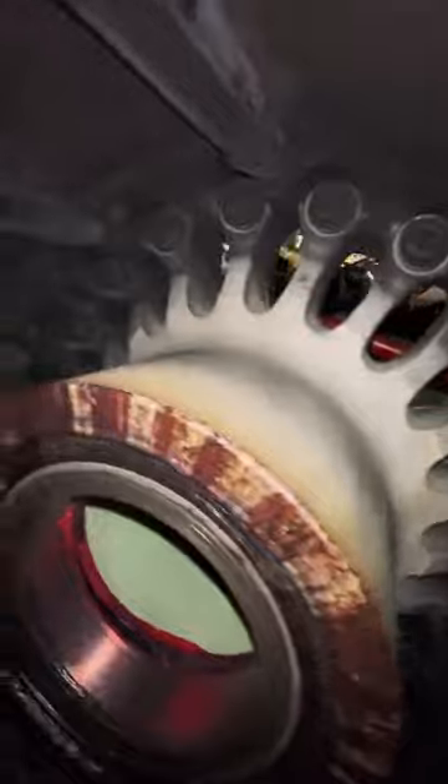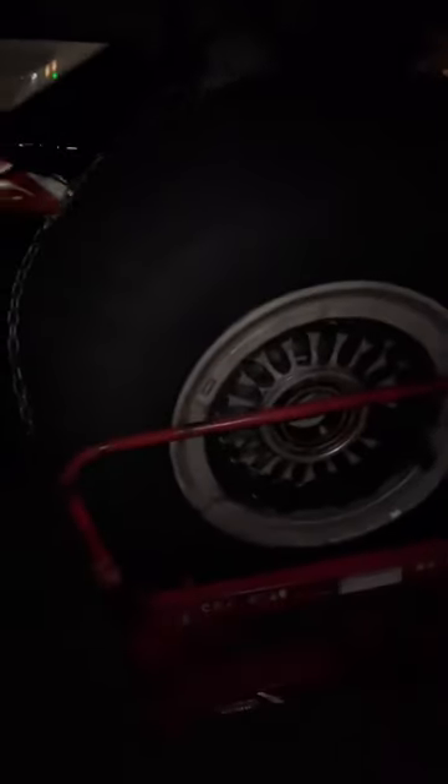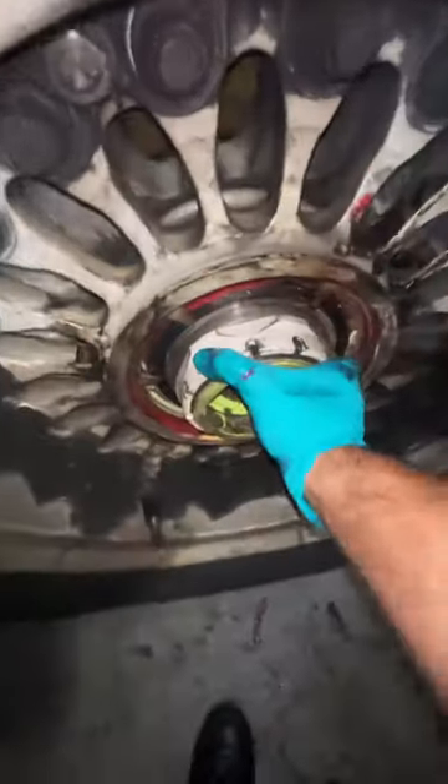After all inspection is done and everything is properly lubricated, now it's time for the wheel. Here's a good example of what it looks like behind the wheel itself. What you see here are the main tie bolts — remember, the wheel itself is a split wheel so it's held together by bolts all across. Pay attention closely and you'll actually see the thermal fuse plugs; there are three of them. Now it's time to reinstall the wheel itself using a tire dolly. These wheels are very heavy so we take great precaution, and it takes a team of excellent mechanics to make this happen.